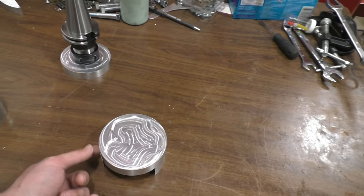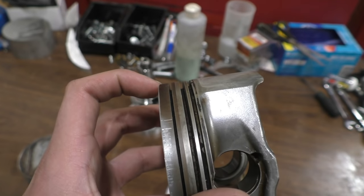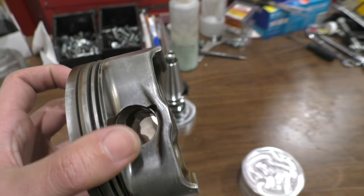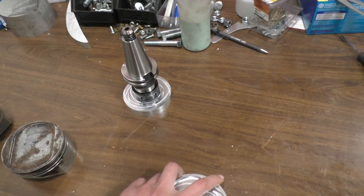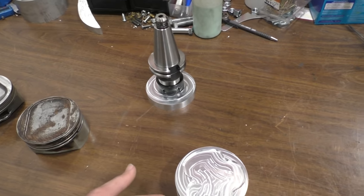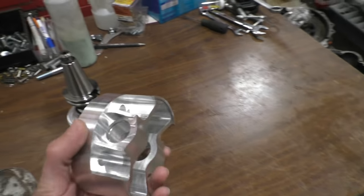The shape on the sides is probably the most critical thing to get right on a piston, so this step needs to be performed with extreme precision. On the same step when machining the sides, we're also going to be adding the piston ring grooves, which is going to be tricky — the top one is a really thin and really deep groove, and I actually need to grind a special tool thin enough and long enough to cut it. For this step, the piston is going to be mounted to the spindle, so we're using the machine like a lathe. We've made a special fixture to hold the piston to the spindle, and a tool clamped on the vise will come in from the sides to machine the final shape, taper, and piston ring grooves.